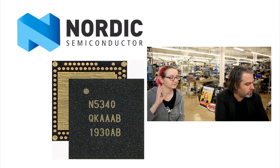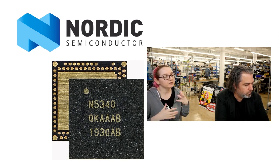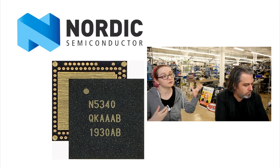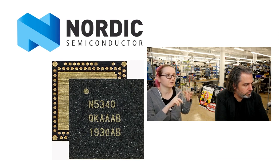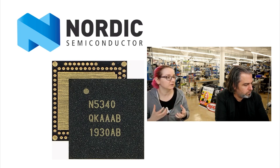The 5340 is a Bluetooth chip and it has two cores in it — two ARM Cortex-M33s. They recommend one runs at 64 MHz and one runs at 128 MHz. Instead of having one processor that has to jump to the soft device to do Bluetooth, radio, and authentication and then jump back to your user code — where your user code can get interrupted for Bluetooth tasks — you now have two processors. One can be dedicated solely to handling Bluetooth, Thread, ZigBee, wireless communications, authentication, data transfer, and buffering. The other processor is just for your user interaction or any processing you need to do with data.